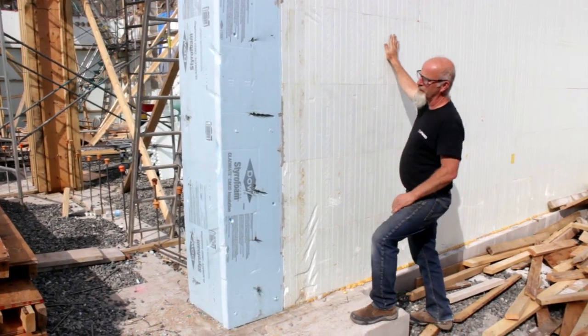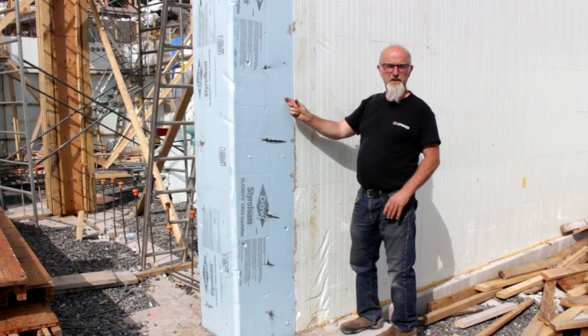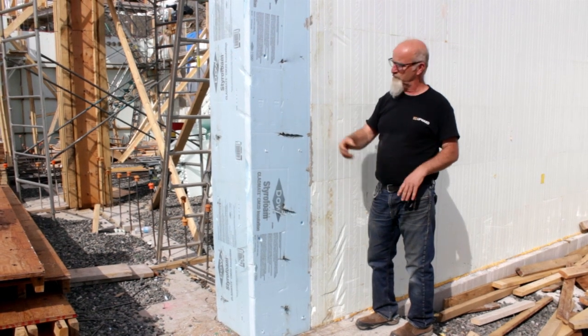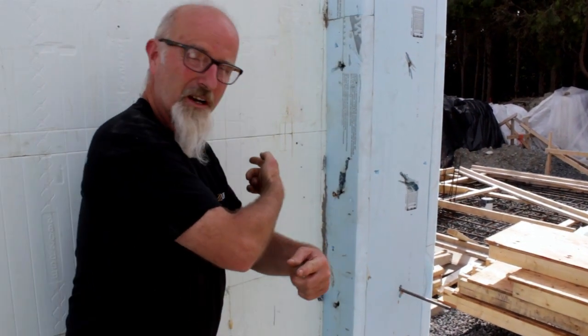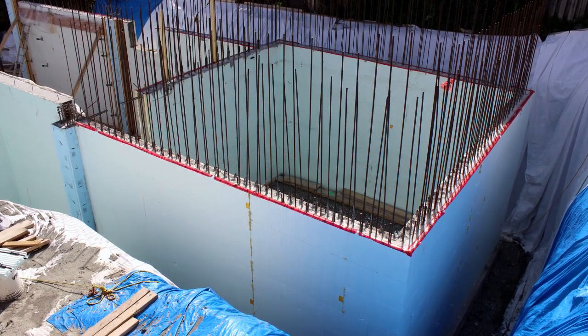The original ICF wall is here and when we built our form we added two-and-a-half inch styrofoam panels to the inside of the form. We used three-inch nails with a little plastic washer to hold it on, and put divots with our hammer on the inside of the styrofoam. The concrete just flowed into those divots and holds it perfectly — the system worked out really well. We had coil rod going through this way because we were worried about expansion, and with coil rod running across it too, it was overkill but it worked great. You can cut the coil rod to any length you want, and looking from above it looks really straight — we're really happy.